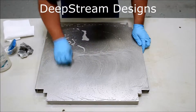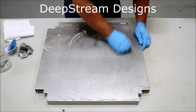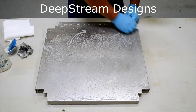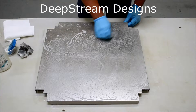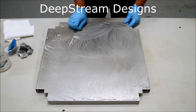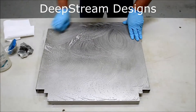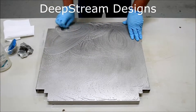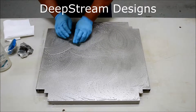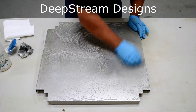You'll find that if you keep this up every six months or so — if you're not near the ocean but it's outdoor exposure and you're getting little rust spots — this will take care of it in just a couple of minutes. You don't need to take them off of your bins to do this. It's not going to hurt the aluminum for the small amount of time that it's on it, and you'll want to rinse the whole bin down with fresh water to be sure that you've got all the citric acid solution off after you've finished.